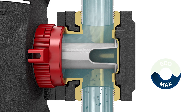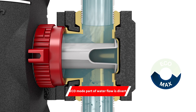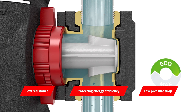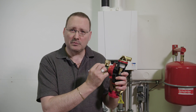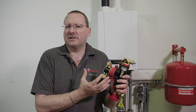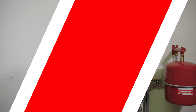Once that initial purge cleaning of the system has been done, we can then adjust the unit into its eco mode. This is where the pressure drop through the unit becomes almost unnoticeable by the wider system, and we're then only continuously diverting a small amount of system fluid through the unit — it's almost a caretaker mode. In this eco mode, we are protecting the energy efficiency of the system as a whole.